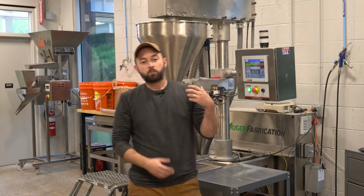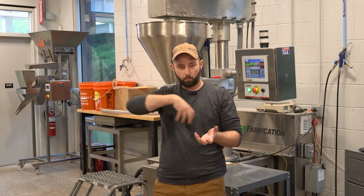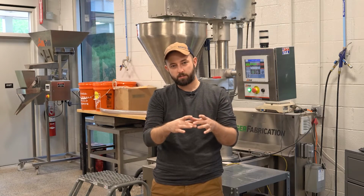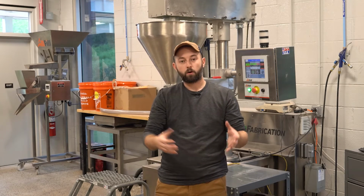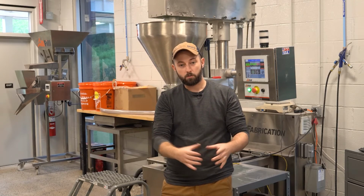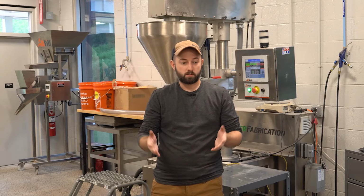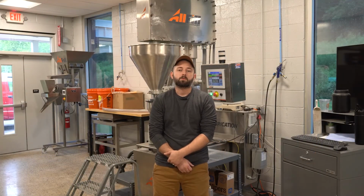All right, so that final clip showed you the benefit of the flake blade with the tines. What you could see is on the outside of the hopper, that material started to bulge a little bit and rotate around the side. And that cavity that developed in the center of the machine is a little bit less drastic. So you've got the effectiveness of the flake blade, getting that material to fall down into the auger. You've got the tines removing the possibility of having a rat hole and a void appear around the auger. So you've got a consistent flow of material with a very difficult light density product. And that's the goal of those different types of agitation blades, is to fix the issues that present with a light density, flaky material.